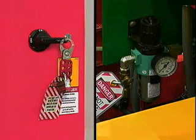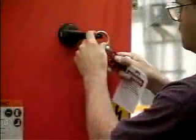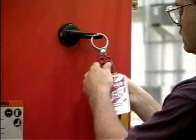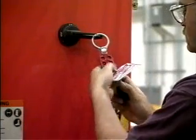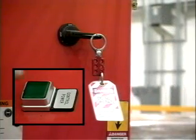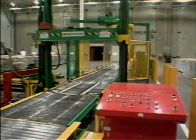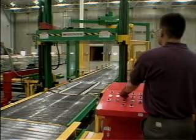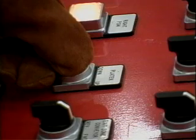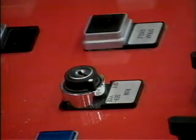SigNode provides the capability to lock out and tag out all air and electrical controls for maintenance purposes. Before servicing the machine or walking on conveyors, insert the lockout tag on the control panel. Secure the padlock and take the key with you so that no one other than you can restore power to the equipment. Ensure that the power is disconnected by pressing the power button. When servicing the strapping heads, you will need electrical power, so instead of locking out power, lower the platen to its lowest position, switch the machine into service mode on the control console, and again take the key with you.